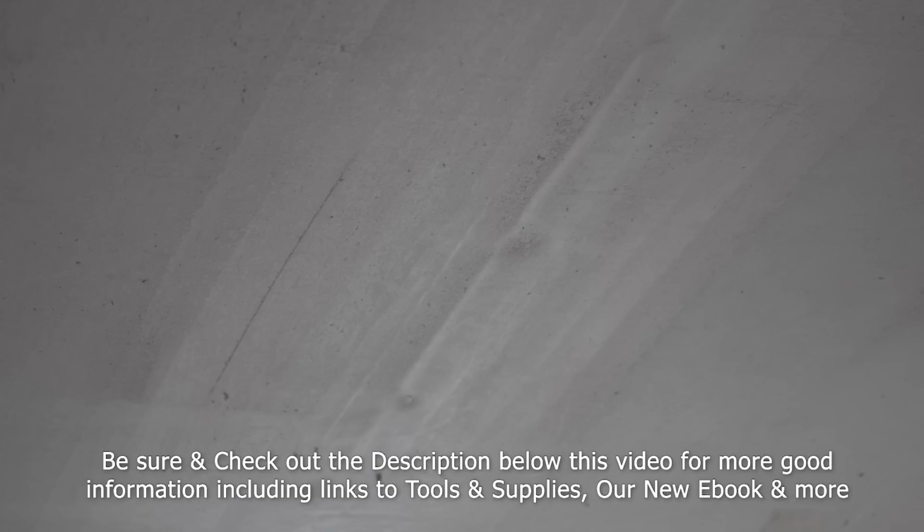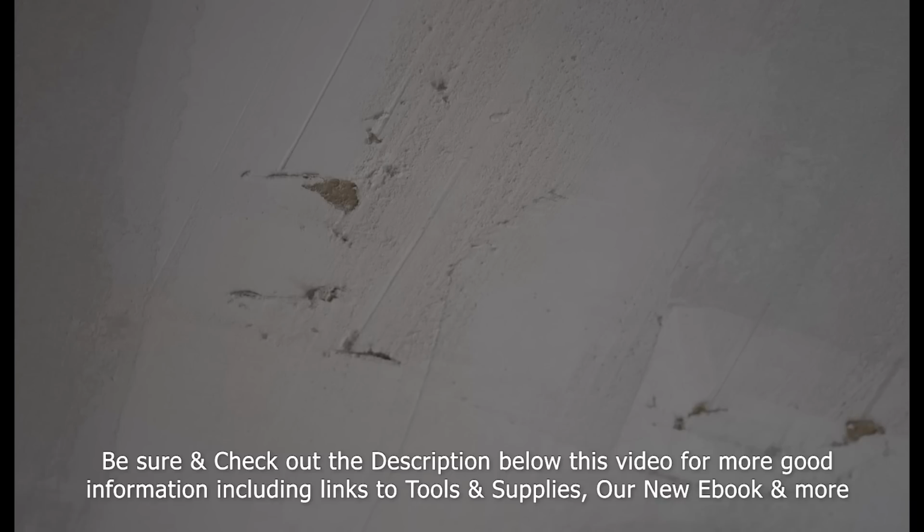For example, you might see things like defects in the joint tape, say, around this patch around a light fixture, or you might see other miscellaneous damage like bad joints that didn't get finished properly, or you may have damaged them when scraping. That needs refinishing, or a lot of little miscellaneous damage like this. So the point is that even if you scrape it really well, you still need to do a lot of repairs before you proceed to the next step, and that next step could be leaving it smooth or applying a texture.